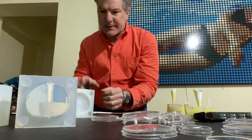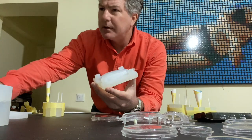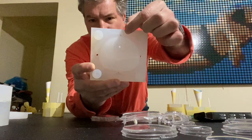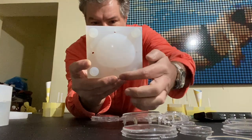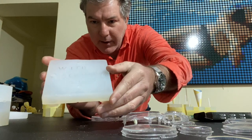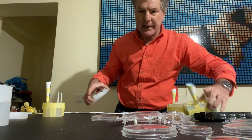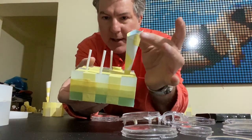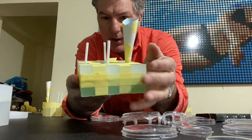The next thing is your gates in your mold — basically the same as designing an injection mold. For example, you can see the holes here on the edge; that would be my fill port here and my air vents over here. You always want to fill low and vent high. You can see here — these are molds I made. I poured a complete mold, bottom and top. Here I have my fill port, which is just a piece of paper I made into a conical shape, and here I have a regular drinking straw as my air vent.